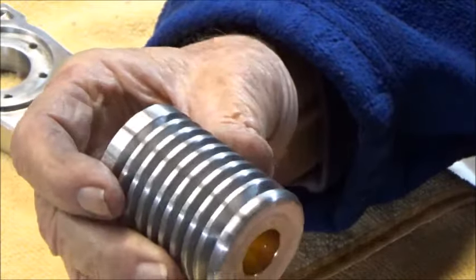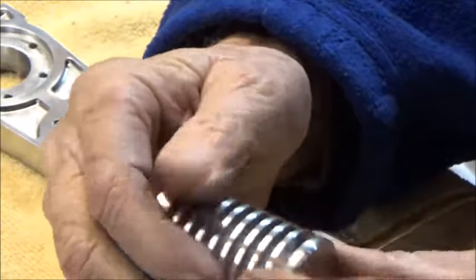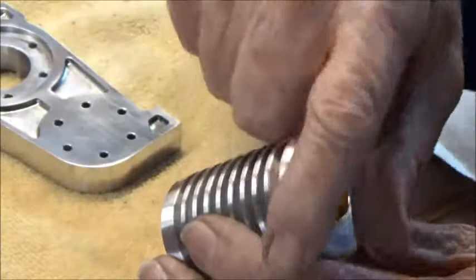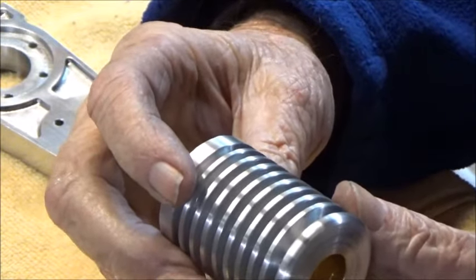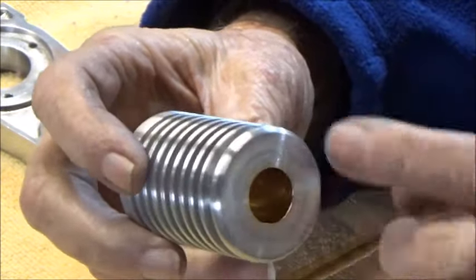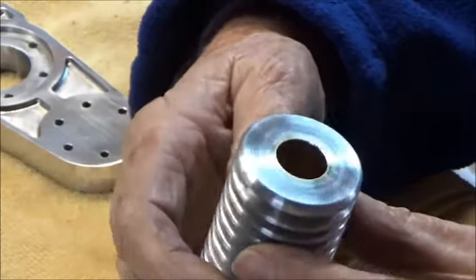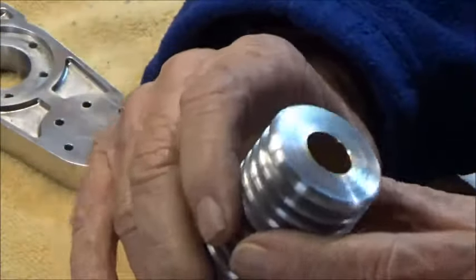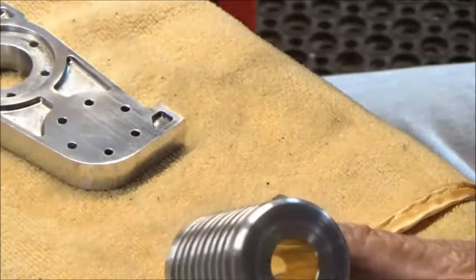I did the same thing — I just hit the edges after I got done with the file, so they're all smooth and rounded. I did a little bit more file work on this thing. The plan showed this as a half-round surface, so I used the chamfer tool and took some off each one of the edges and then rounded it off with a file. The aluminum file is real easy, so it's not a problem. I'm assuming this surface is nice and flat — if it's not we may have to clean that up. These mating surfaces have to be flat so we don't have any air leaks.